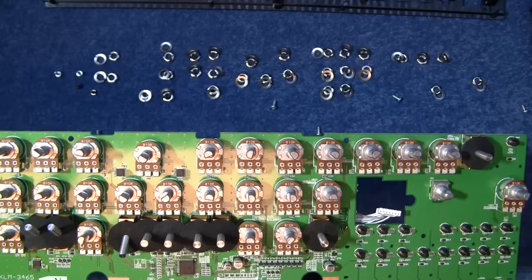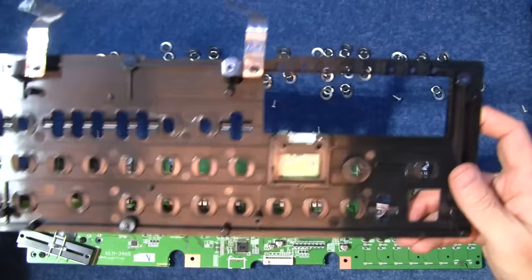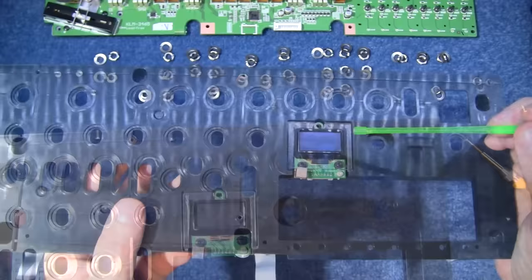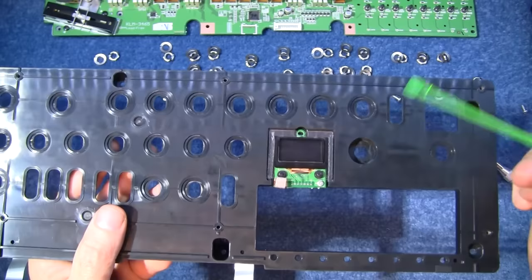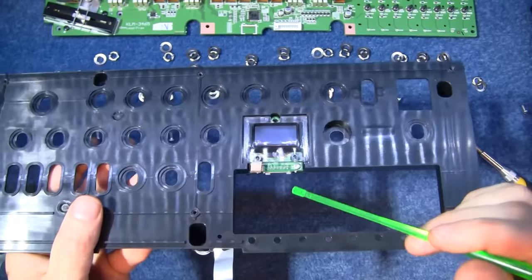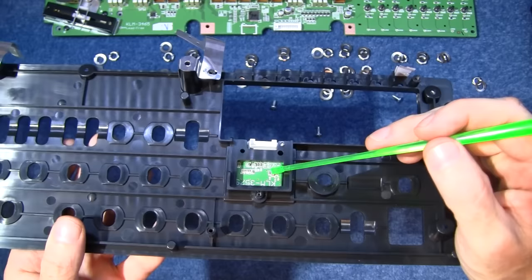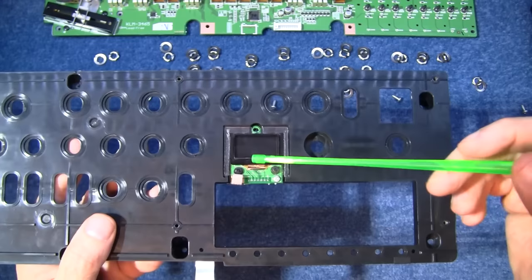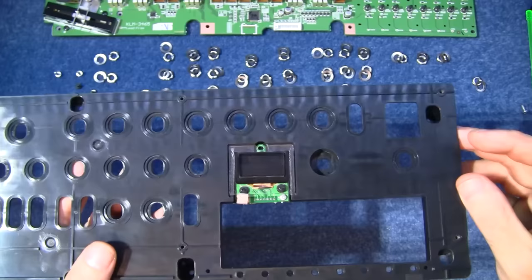Now the oscilloscope. The little oscilloscope display is still on this cover here. The display is actually glued down so I can't get that up. It's an OLED display, 0.96 inch across — very visible, very crisp and sharp. It doesn't look like there's any processor on the display board itself — just a standard communication port and a few resistors. The oscilloscope waveform will be generated by one of the ARM processors on the main board.